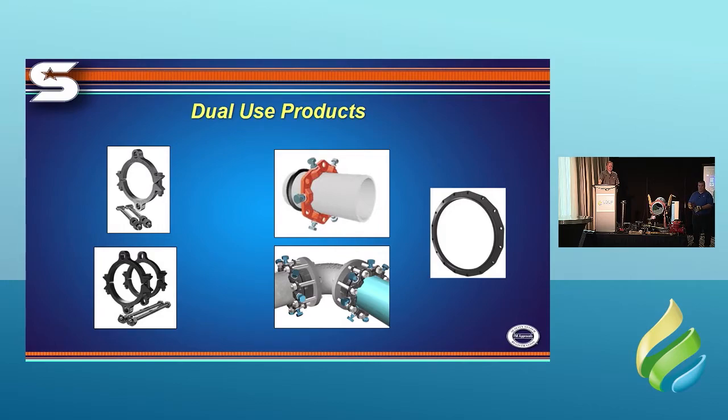Especially if it's MJ, we've got a lot more of it in North America. It's easier to move it around and get it to places. So the costing, pricing and quoting is definitely better and more advantageous to go C153 over C110. The products both perform well. Yeah, they both work. The only reason I've seen why some people use C110 over C153 is because on occasion cities are slow to change standards, and the C110 has always been in there, and the C153 just has, for whatever reason, not made it into the standard. There's no technical reason not to use a C153.